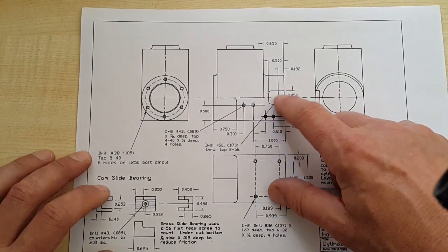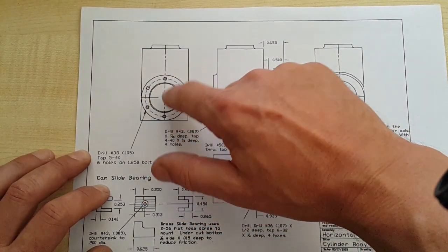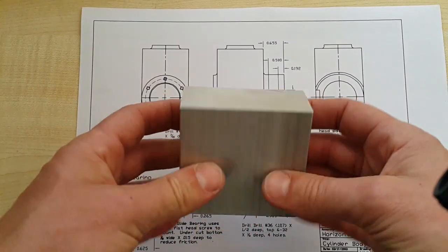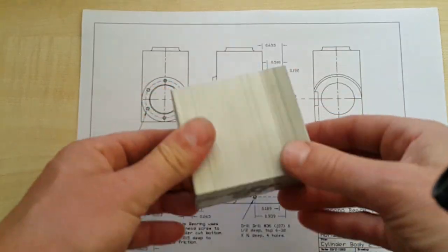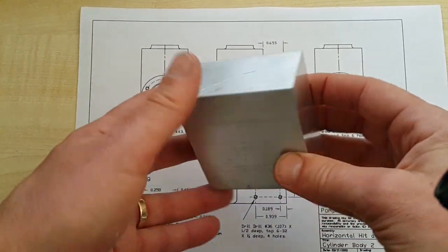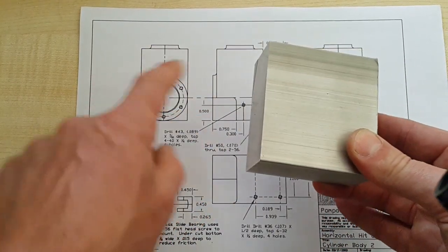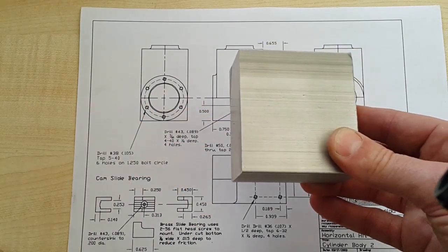There's just some other machining we need to do on here as well, obviously for fixings and various things. There's going to be a drill pattern here for the cylinder head. So that's the drawings. What we'll do now is machine this block down to size and then start the various processes. We're going to have to plan what order we're going to machine this in, to make sure that when we get to the last machining we can actually hold it. Probably going to start off with boring the cylinder sleeve first, then putting the bolt pattern on the end for the cylinder head.